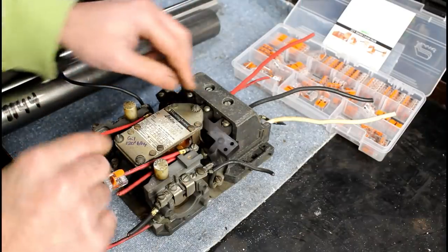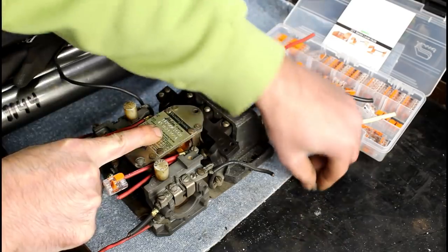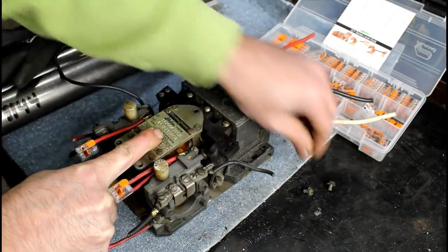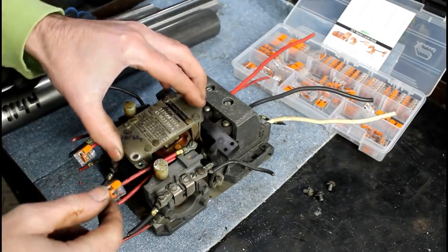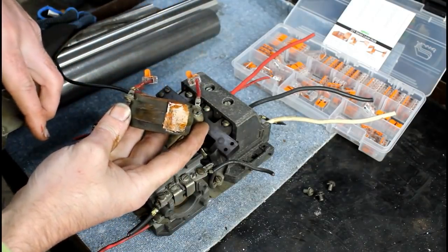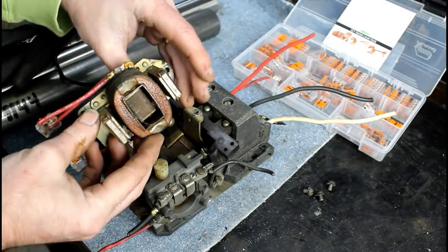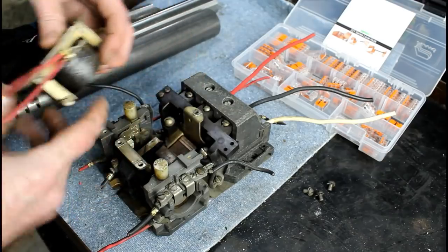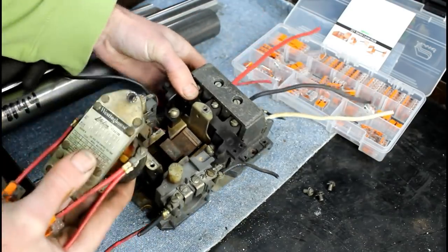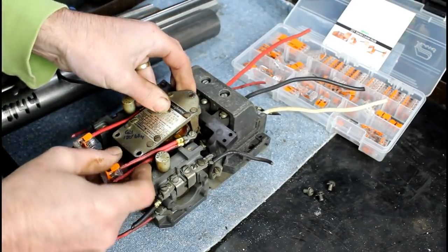So here's the motor starter that I showed last week that I pulled out of the saw's original electrical cabinet, and as luck would have it, the coil on here, which I questioned last week, its voltage happens to be 120 volts, so that's fortunate, and I'll be able to use it. All it does is sit in there like that through these laminates. It's got the other part of it down in there, and it just pulls that together and makes a contact. So let me wire this up real quick.